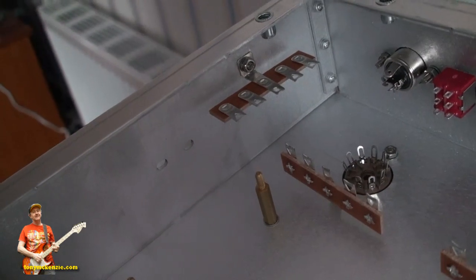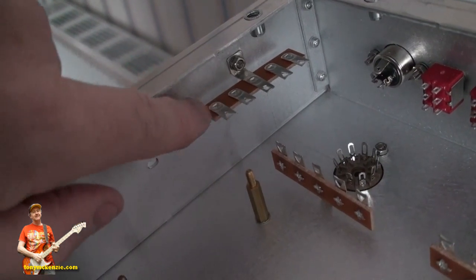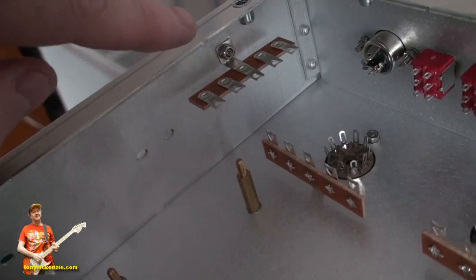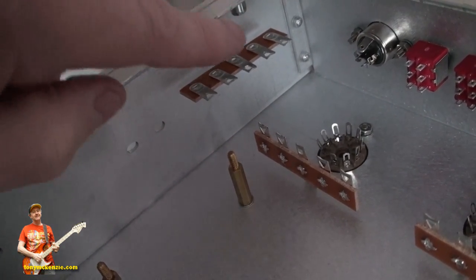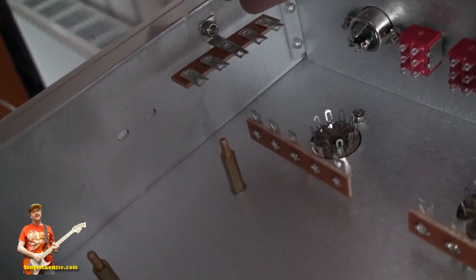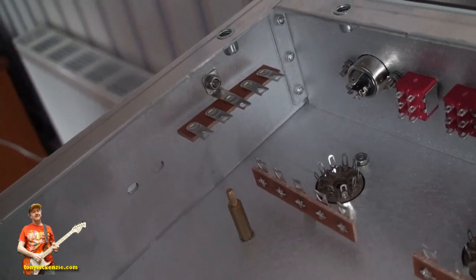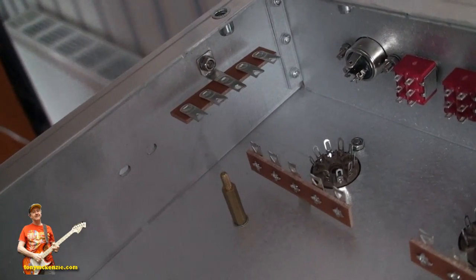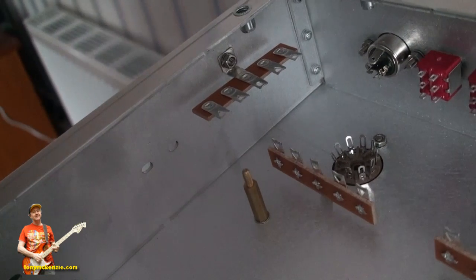Here's one thing to note: when I originally fitted this five-way tag board, I did actually fit it the other way up, and there's no obvious instructions. When you fit it the other way up, it ends up about an eighth of an inch from the mount, so clearly that was the wrong way to do things. When it's fitted, just make sure that these tags are on the top, then you can't really get that wrong. But do watch out — it's things like that that can simply get you killed.